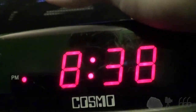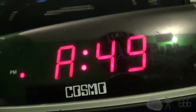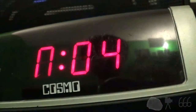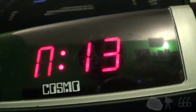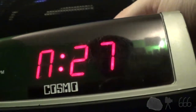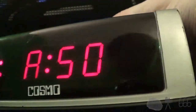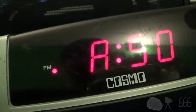We'll go through the fast setting here. Now you can see the slow button doesn't quite work the way you'd expect. So it's 8:49 PM. I want to show you the special feature. On the back there's a switch — it says alarm on, alarm off, and seconds. What does the seconds switch do? It shows you the seconds that have passed since you set it, I'm assuming. This digit actually seems to do something. I think there's a little broken solder joint in here somewhere. But anyways, that's pretty cool. I haven't been able to get the alarm to work.